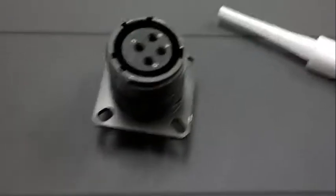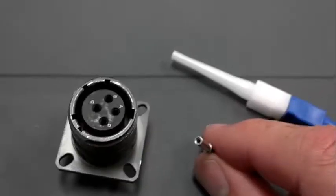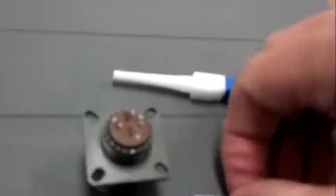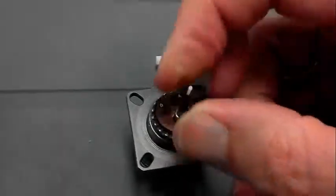This video will show how to insert the EL series optical fiber contact into a standard 38999 shell. This is done with the standard copper contact insertion tool. First, place it into the cavity that you want to insert the optical contact into.